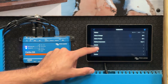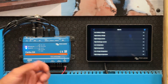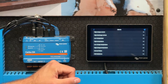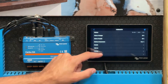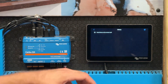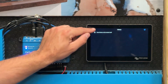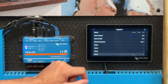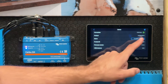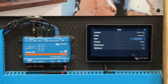Going back one level, we can also see Alarms — so if there are any alarms such as low battery voltage, high charge currents, or low charge temperatures, you would see these here and they would also pop up as a warning on your touch screen or via VRM. History is not visible on the touch screen; you will see a reset history option on the monitor itself, but that is only accessed through the ROMA Smart app and won't come through to the Victron Cerbo GX. If we tap on Device, we can see connection details — we're connected via CAN bus, our product is a 160 Smart 4 from ROMA, you can give it a custom name, and you can see some firmware versions.